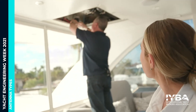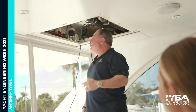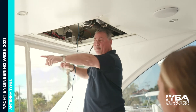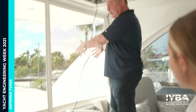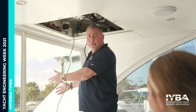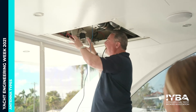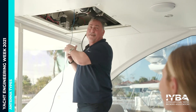Michael, how are you going to get those wires from the hardtop to the AV cabinet? No two boats are the same. Generally, we've got to pull down the overhead panels and open up the arch, as you can see behind me. Sometimes you've got to pull out a refrigerator and just find that cable chase. A lot of manufacturers put holes in and make it easy, and others don't. But that's kind of our trade secret in this business — the great magician never tells his secret.